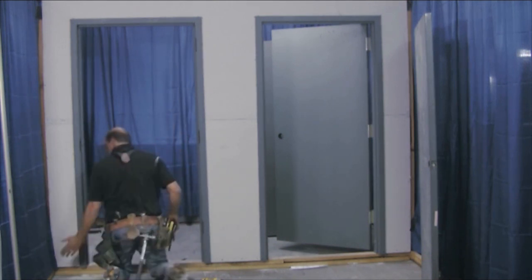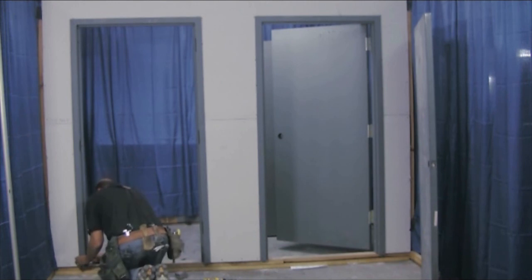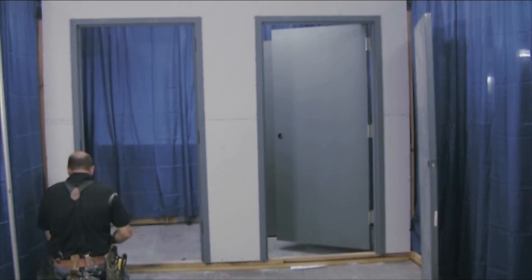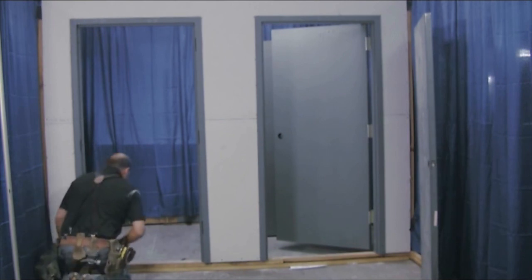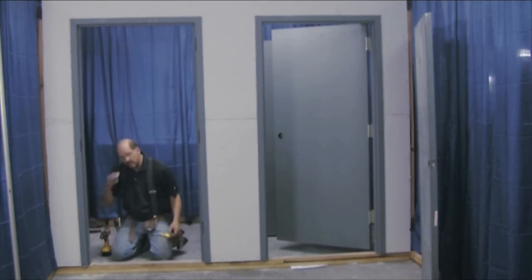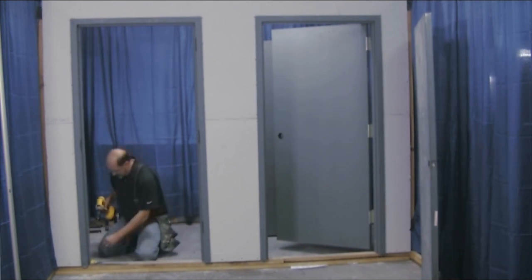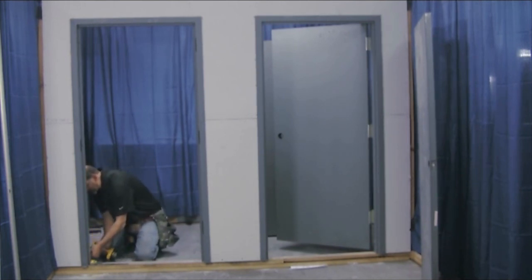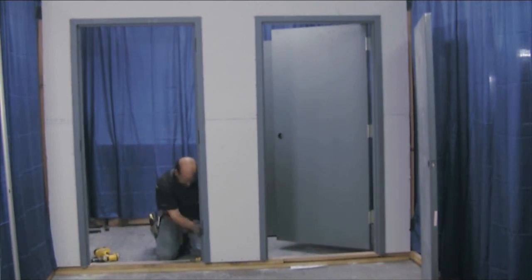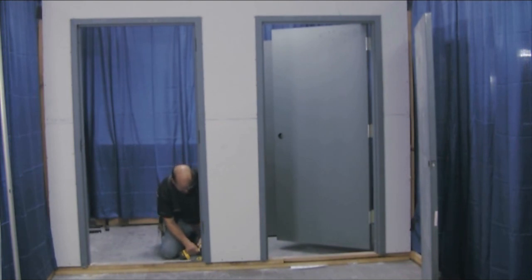So you want to come over to the other side and measure across. You want to be 36 inches — you need to bring this one out a little bit, get it right at 36, then go ahead and screw it in place. Now jump on the other side. You've got two screws in the bottom trim face, same location. What you want to do, you can eyeball this or use a square — you want to make sure you're nice and square on the wall and on the stop, then run the screw in. If you get that a little bit off, it'll affect the way your door swings, so I always like to use a square.